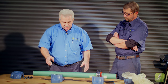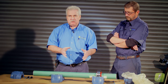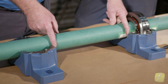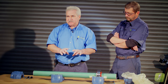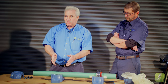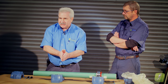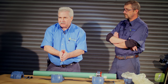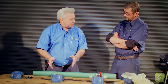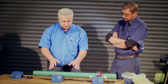The formula from our last class is to calculate the distance between the two bearings and do the calculations to find what that thermal growth is. That's the amount we're going to want to take out of the housing, along with taking 20 thousandths off of the cap on that end. That's just to make sure there's no clamp on the bearing from the bearing cap.